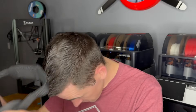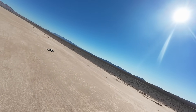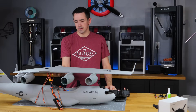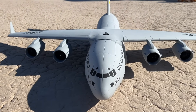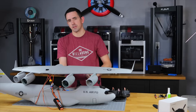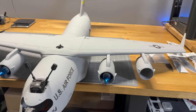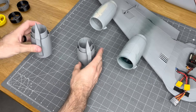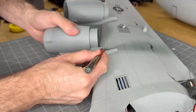There's one more thing included in the FPV kit. Most FPV flyers want to fly for a while, but EDFs don't have the longest flight time — propellers are more efficient. You can fly it with the EDFs or switch to propellers for longer flight. I designed a motor mount that goes inside the nacelle and holds up to an 8-inch propeller. Rather than reprinting the entire wing, I'm going to show you how to work on a 3D printed airplane — print out just the parts you're cutting off.